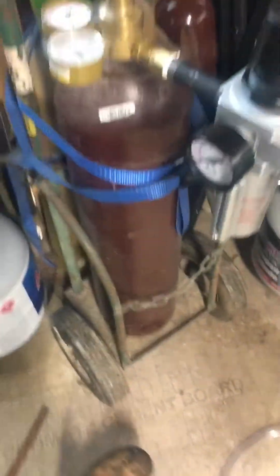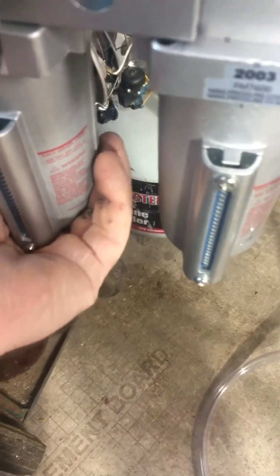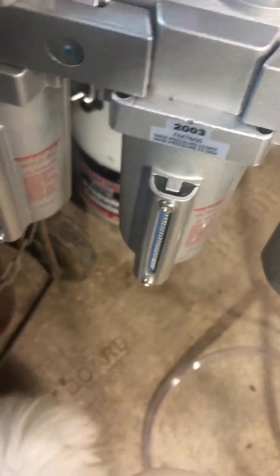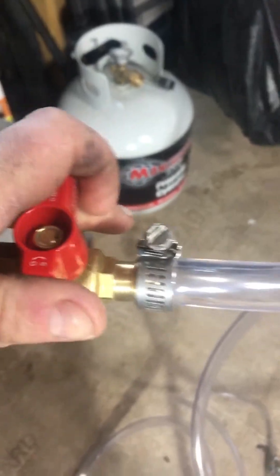This first stage needs at least 30 pounds of pressure to activate a valve inside. The tank has a thousand pounds in it — this regulator brought it down to 30, and then from there I brought it down almost to nothing, because you don't want a lot of pressure, you want to go slow. I even quarter-cracked this valve even further to fine-tune how much gas is going in.